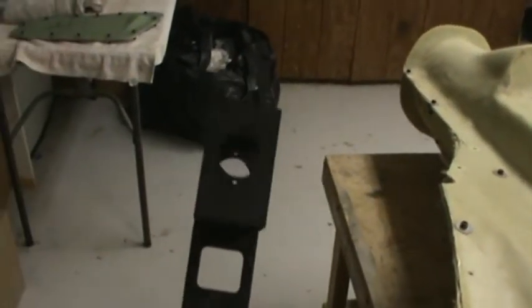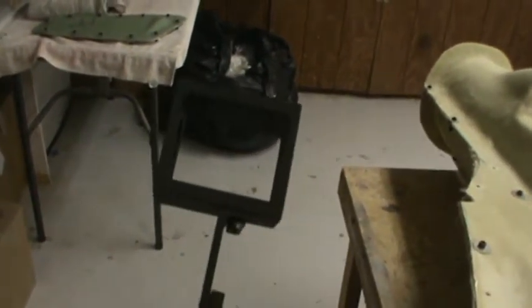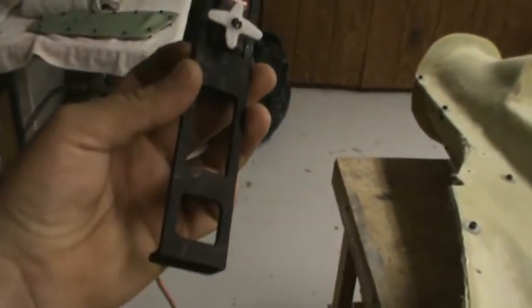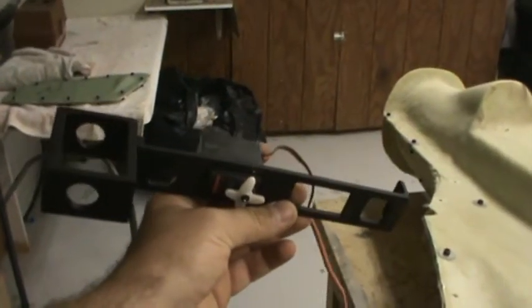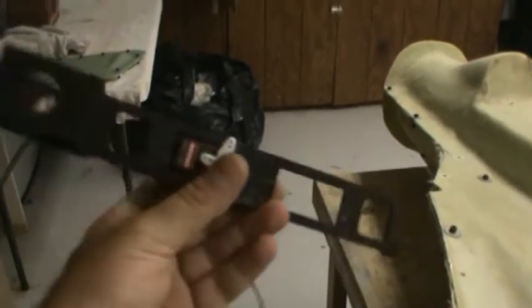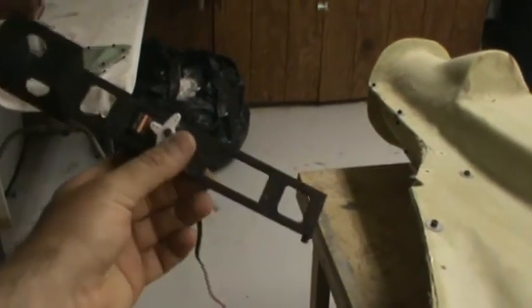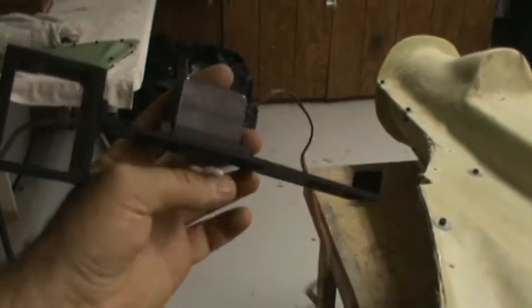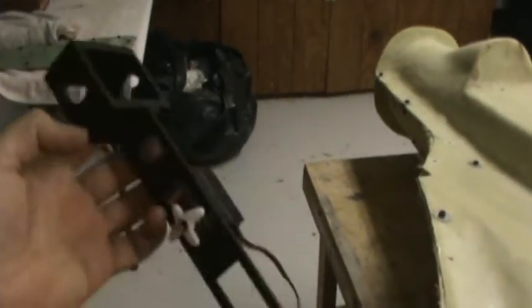And then the rest of the horizontal stab mechanism — this box here supports two ball bearings and the pivot shaft along with the control arm. This piece with the servo in it is your servo mount, and it has pretty good leverage. It's about 12 inches long and will have four bolts through a bulkhead and another three bolts through here, with two 8711 or equivalent servos for the stab control. All of this will be machined aluminum, and I might add another bulkhead on both sides of the box for extra support. All these are currently 3D printed parts.